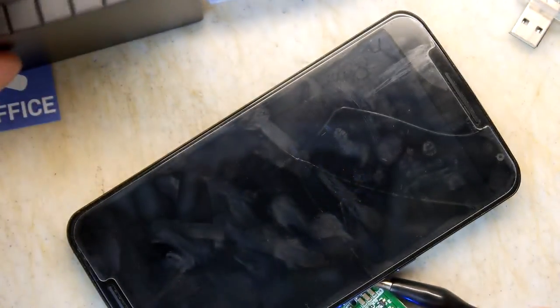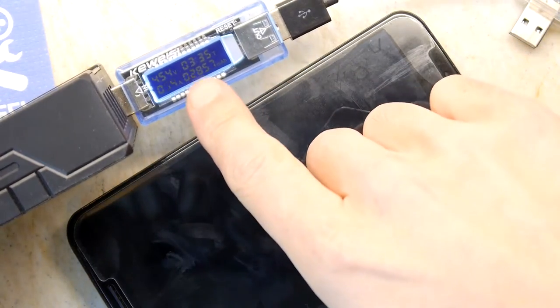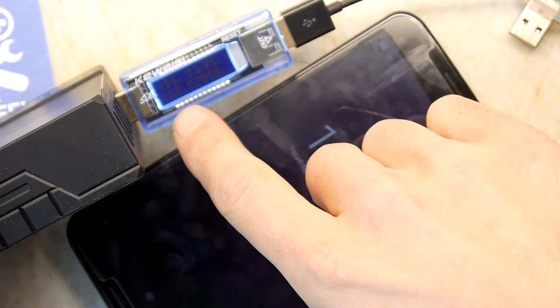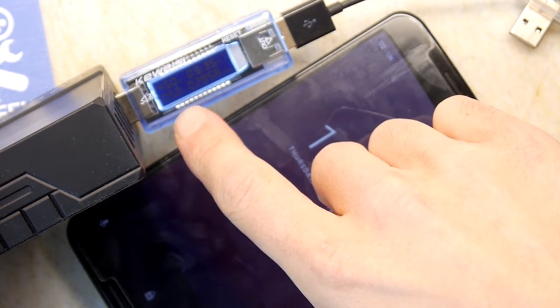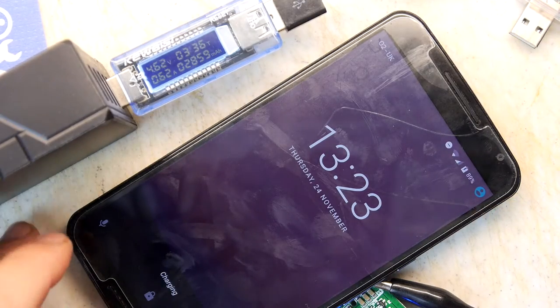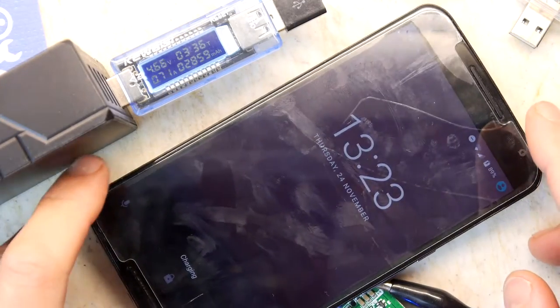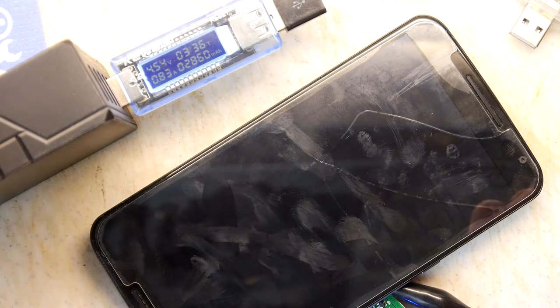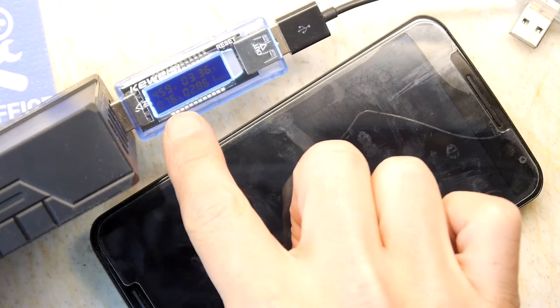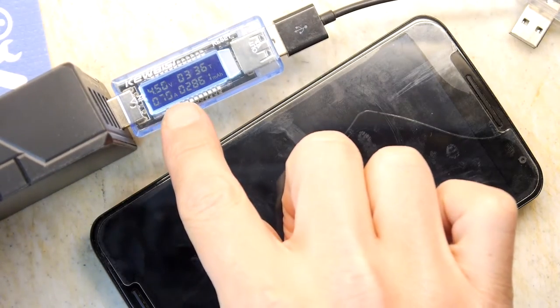Okay, so the phone's come on. We're reading 4.54 volts with 0.6 amps. There we go. It's sort of fluctuating a little bit as if it's not quite happy, and I can see the phone actually going on and off, so we're going to reposition the phone slightly. That looks stable now. 0.76 amps. So that's really interesting. So positioning, obviously, you need to get those antennas